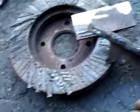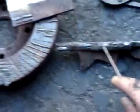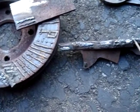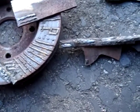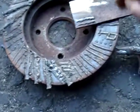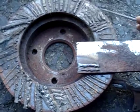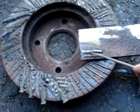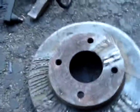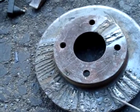Another thing I noticed: if you do a couple of root passes they're going to look bumpy and funky, but if you put a pass on top of the weld, now you're on top of good steel again and you're going to get nicer welds on the overlap. So you can use the cast iron as a base, lay down some weld over here, clean it up, and you'd probably get the nice ripples. Same thing here — the second layer is smoother, but the single layer looks kind of funny.